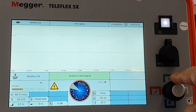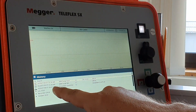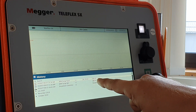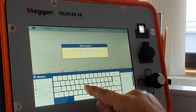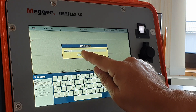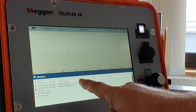I would find my measurement in the history and see the measurement from just a moment ago — in the 16kV range, using 6kV, in a measuring range of 200 meters. If that is not enough information, I can simply edit a comment and add a note like 'good one.' So if during fault locating I want to go back to a measurement from an hour or two hours ago for comparison, I can do that. If I have many measurements, I can distinguish them by their settings or by a comment I enter.